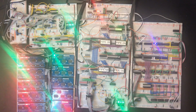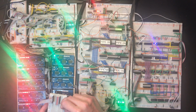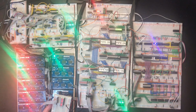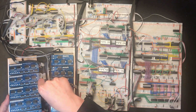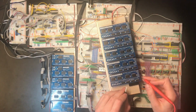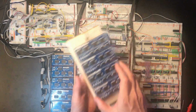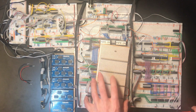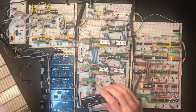I don't think you can see that here, but I do have a connector at the bottom that I can plug cables into. So what I want is to get a view of what's on the bus. Okay, so we're seeing the problem actually on the bus, so this is a problem with what's being asserted. I need to take them all off. We don't have a bridge connection along there anywhere. But a bridge on this chip on any of the boards could cause that effect.